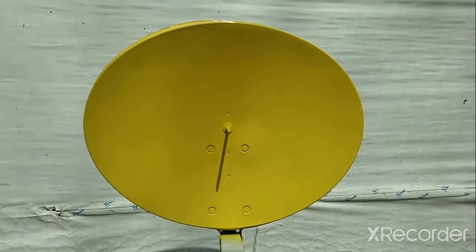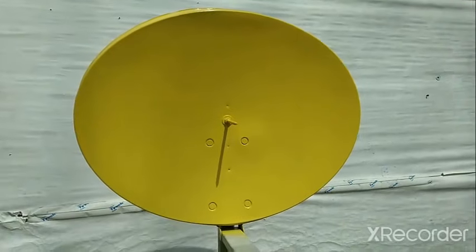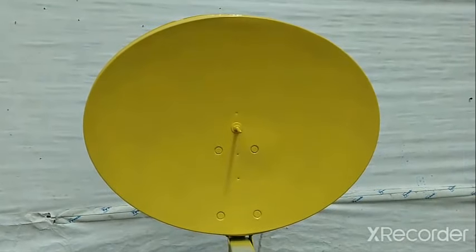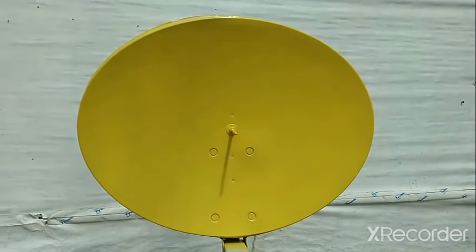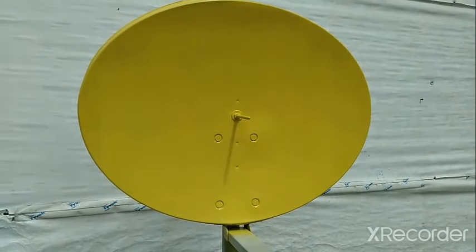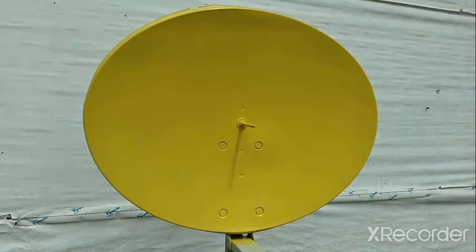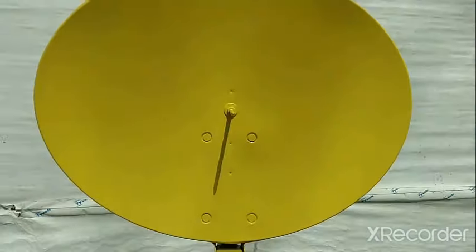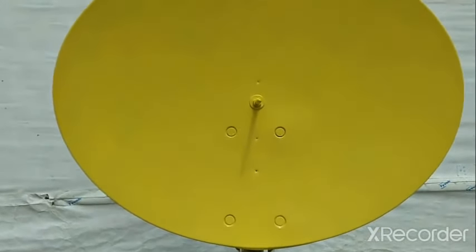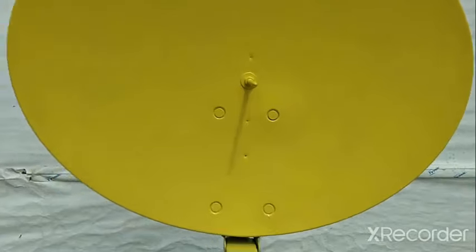You see how easy it is to build a sundial? Not quite as easy as sticking a stick in the ground, but it took us a total of 15 to 20 minutes to get this done. And it's actually better than a stick in the ground. But setting it turns out to be a little more difficult. Many followers of our channel have reported difficulties understanding how to set the dish. Setting it isn't complicated — we just have to understand how. You have two directions to move the dish: the tilt, which is up and down, and the rotation, which is side to side.